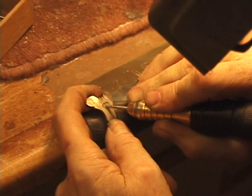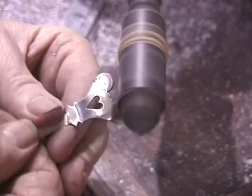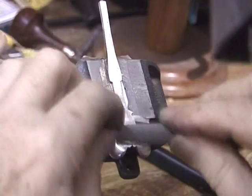Now, roughing out the heart shaped hole in both keys. Finishing is always done by hand. A little bit of rough shaping of the surface before we do some hand finishing and polishing, making sure all surfaces are crisp. Some silver makers prefer to burnish the surfaces in the final operation, a good traditional technique.